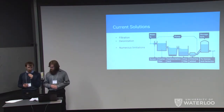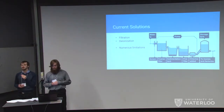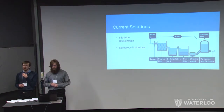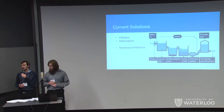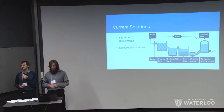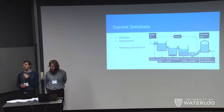There are other solutions available. The primary two are deionization or nanofiltration, which separates two volumes of water by a very precise filter, slowly filtering out heavy metal ions. However, this is problematic because it is very slow, requires large scale, and wastes significant amounts of water left with highly concentrated heavy metal ions. Another option is resin-based deionization, where resin containing complementary ions is submerged in water to replace heavy metal ions with less dangerous ions like sodium. However, this is also slow, expensive, and the replacement ions are not completely safe.